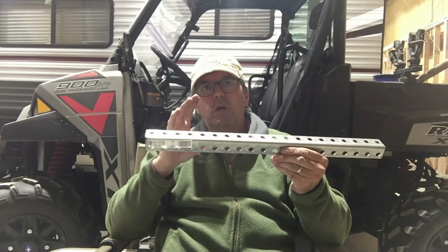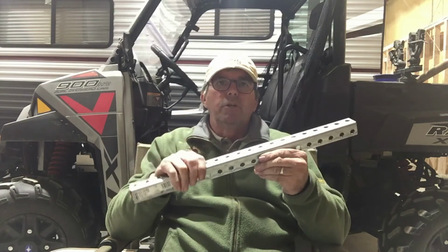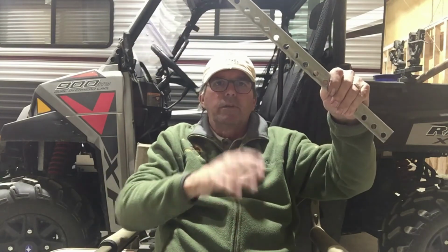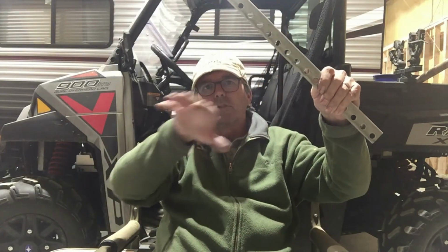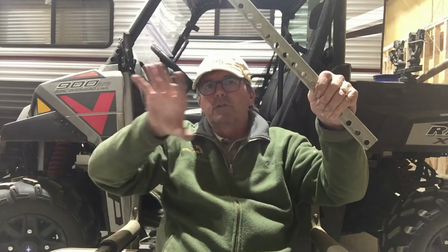When you get through putting the tubes on there, then there's a reflector shield. You'll see that too. That reflector shield, you can tilt it any way you want. You can tilt it at 45, or make it flat this way. The heat comes down, and if you tilt this way it deflects the heat this way. So we put it at about a 30 or 45 degree angle, so it pushes the heat across the shop this way.